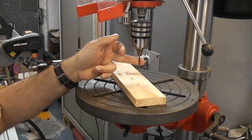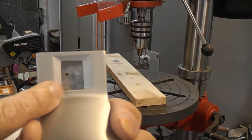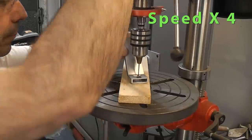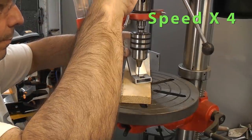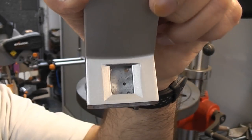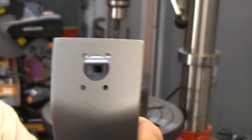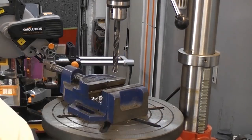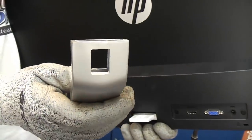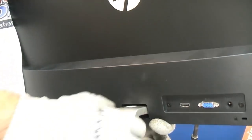I'm going to drill a small hole in each corner. We've now got the four holes in the corners and we're going to swap to a larger drill bit. We now just need to file that until it is square. We've now got the square on the opposite side just like we need it, so that will engage that way like it did normally. You can then swap that over and it engages again.